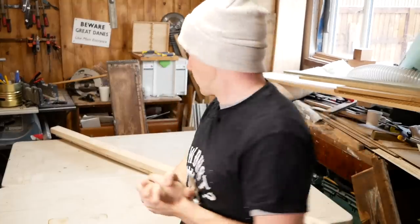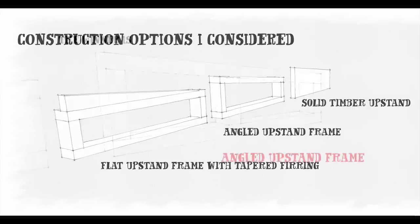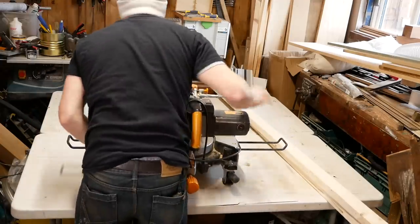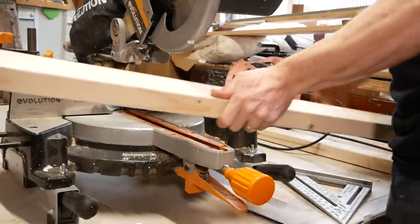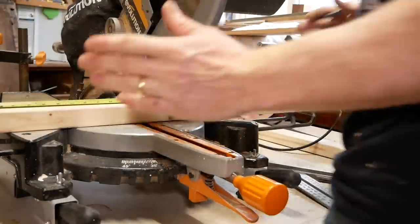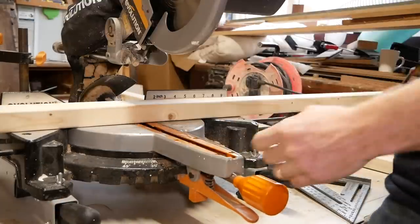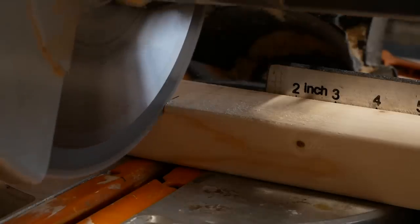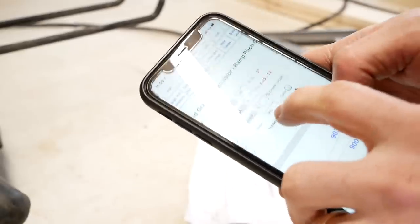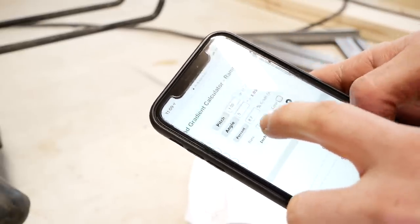Anyway, that's enough of the basics, let's make a start. Our roof light needs 900mm in width by 1200mm in length. I'm going to do the two 900mm ends first. Using our little roofing calculator here, five degrees is the angle we're aiming for. Over 900mm at the base, that gives us 903mm for the top length of timber.